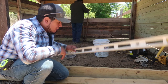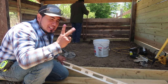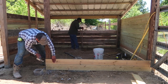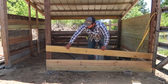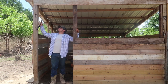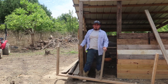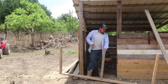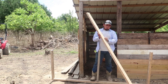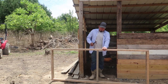You want to make sure you use your level on the bottom one — that way you're secure that the rest of them are going to be nice and level. Don't make that mistake twice — well, I made it once, I didn't make it twice, but you get what I'm saying. Alright, so that one's ready — now we just keep on going up. Now that you got your boards all the way up, next we got to make a door. Making a door is pretty simple. You got your beam — your two by four — that's going to go right here, then your middle beam going long ways. We're going to put one in the middle, one up top, one on the bottom, and then grab your other two by four for the other side. Let's nail it down.